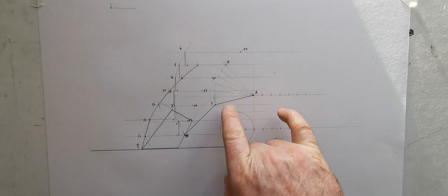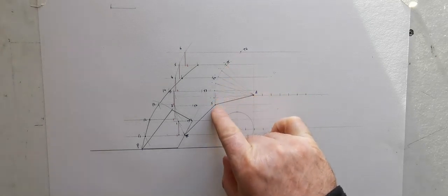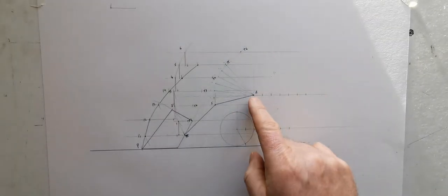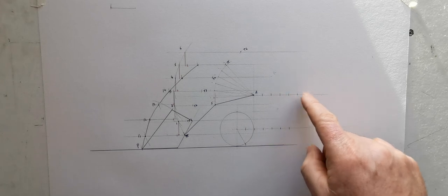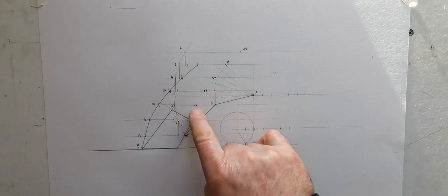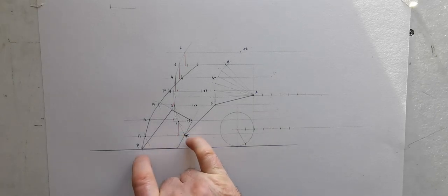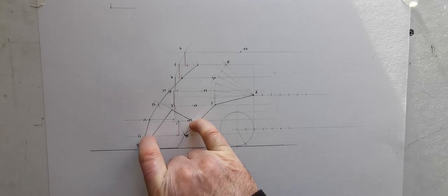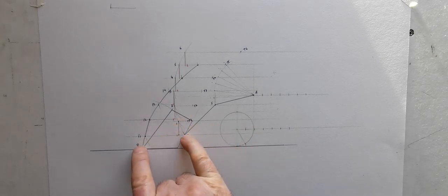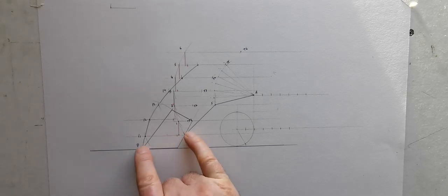So again there, how did we do it? Well, this moved by 60 degrees. So I broke it into 6 different heights there of 10, 20, 30, 40, 50, 60. The movement was broken up into 6 here as well, moving in this direction. So I found the 6 different positions for T, and then just used the 15 millimeter height drop there, and the fact that the distance from T to P is always the same because of the bucket staying horizontal, so that doesn't change, and it wouldn't change anyway, I suppose, because it's swiveling around there. But yeah, so that was it.